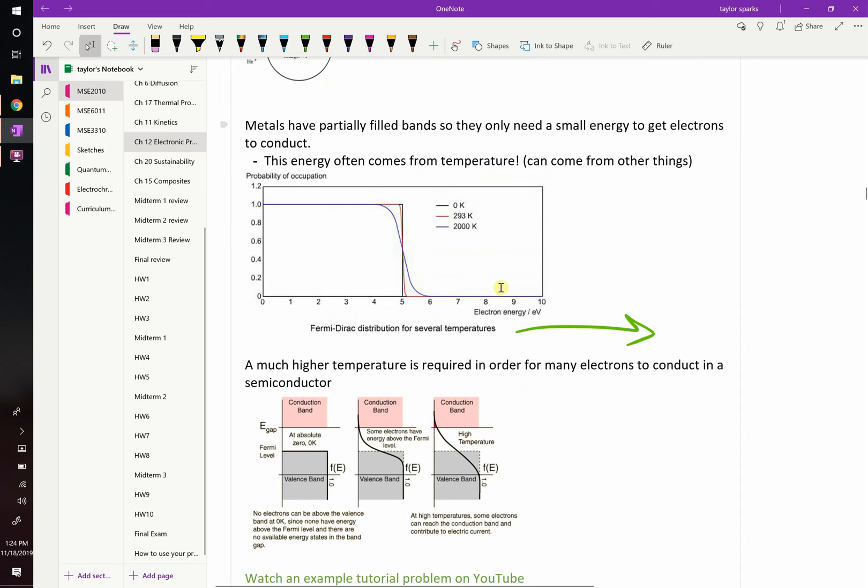There's a mathematical expression — the Fermi-Dirac equation — that calculates exactly what that smearing looks like. If this is the top of your valence band and that's your conduction band, electrons need to get across that gap to conduct. At low temperatures you don't have enough — it's 100% occupying the valence band and zero in the conduction band. Heat it up a little bit and you lose some occupancy in the valence band — those people moved upstairs to the conduction band. So you start getting conduction in both the conduction band and the valence band.